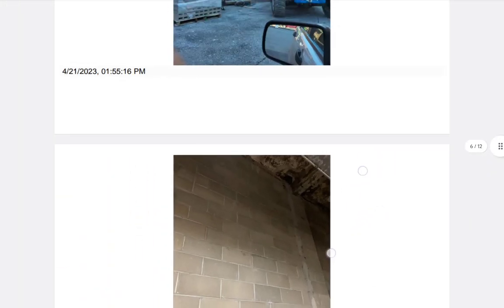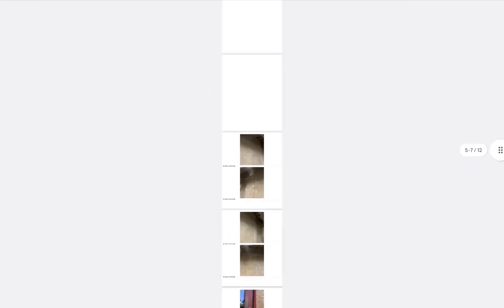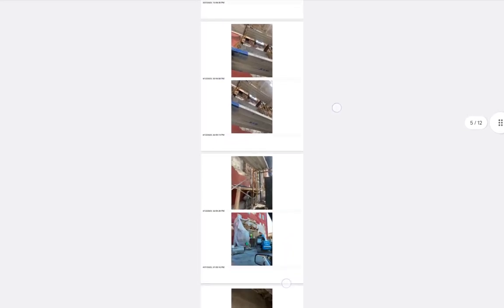And now again, here's that joint, but what's tying it together? What's tying these together? And also at the other end where the building collapsed, what was tying those columns together, columns of brick? So this would be a column here. All right, then that's another column out there. It's not connected. Remember, he had dowels that he wanted to put in there, four of them on each side. Probably insignificant, the way the brick are so weak that it wouldn't be able to get the true intent of the bond and acting as one, the behavior to be one. That's my thoughts.